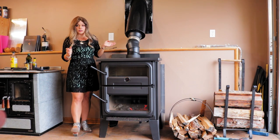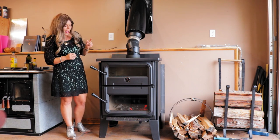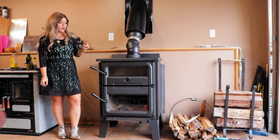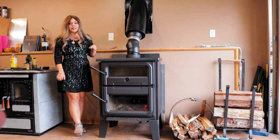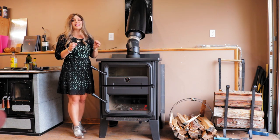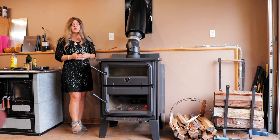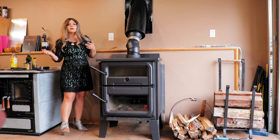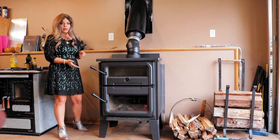I'm going to show you guys the Drolet Bistro. This stove has only been run for two days and I have almost an inch of ash in the bottom of the firebox after two days. An inch of ash is actually about what you want in your firebox for insulation purposes, because having a little bit of ash in there actually helps to get a little bit longer burn times. So that's something to keep in mind — if you clean it out completely, in approximately one to two days you'll get that inch of ash back in place.